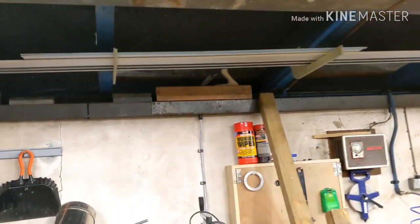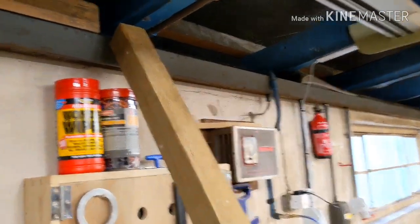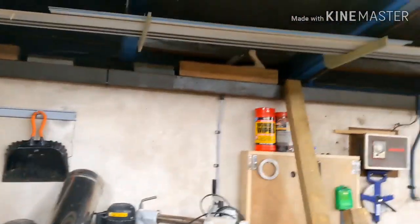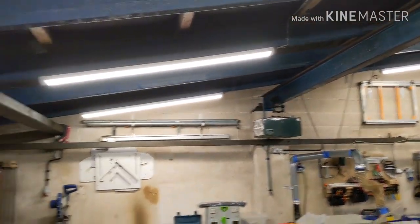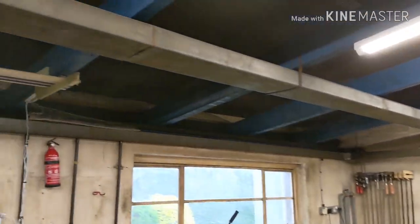Now I don't really want to put it in front of the cable tray, just because if we ever want to move anything, it's another thing you've got to get out of the way, and there's bound to be some upgrades hopefully in the future, assuming everything comes back good again. So I don't really want to tie myself into a corner where I can't upgrade stuff so easily, because it means taking all the ducting down to get into a cable tray.